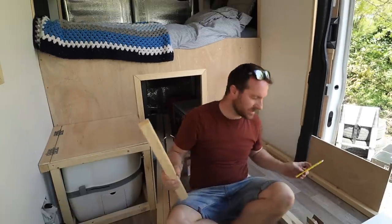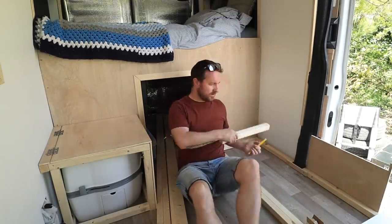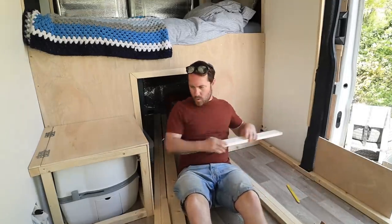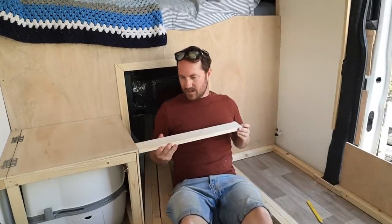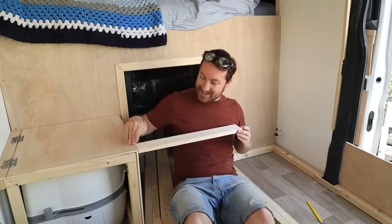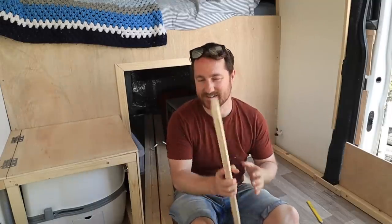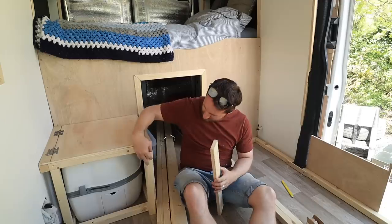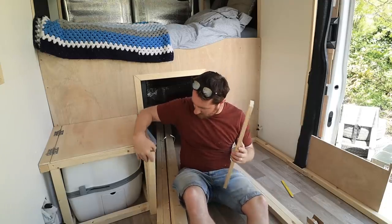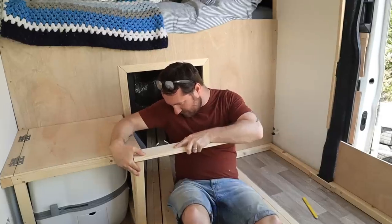In order for this to work, when this part of the bed pulls out from here it needs to line up exactly with the same height as the toilet lid. That means the upright needs to take into account the thickness of the slats, which is 18mm. So it's not as simple as just making it the same as the other one — we need to go up and then that needs to be 18mm on the top.